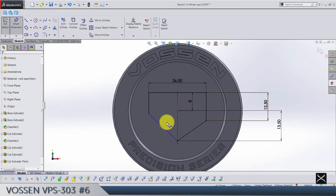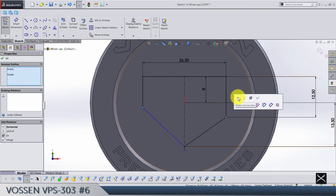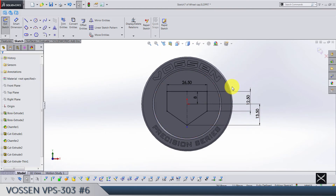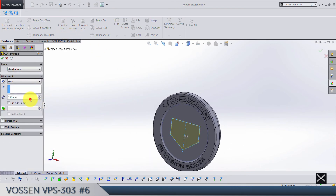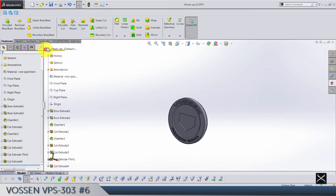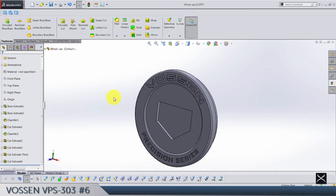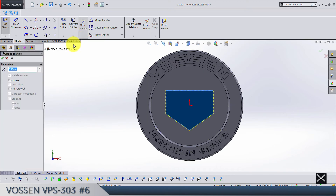This point should also be horizontal with this one, so it's symmetric. Exit the sketch and cut this inside by 2. Now sketch on this face — use offset entities, 0.1, reverse to the inside.